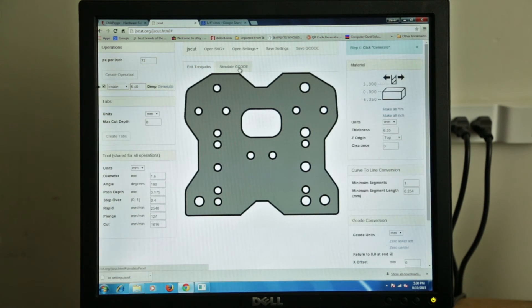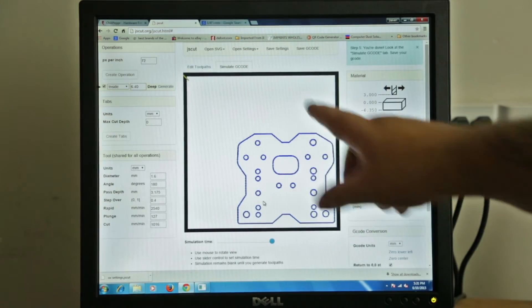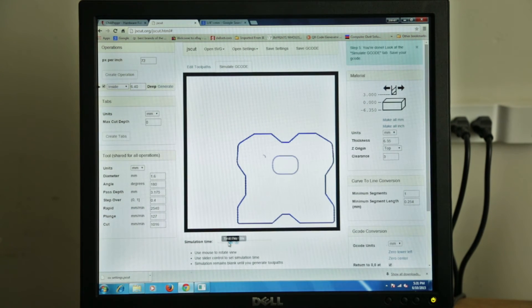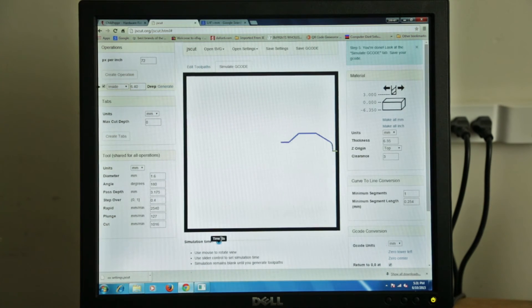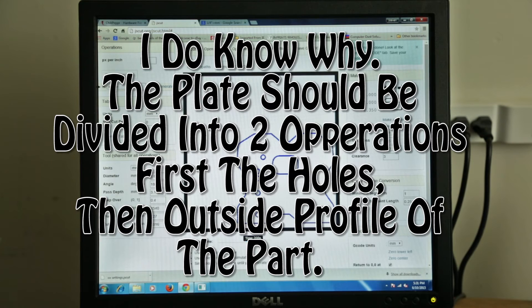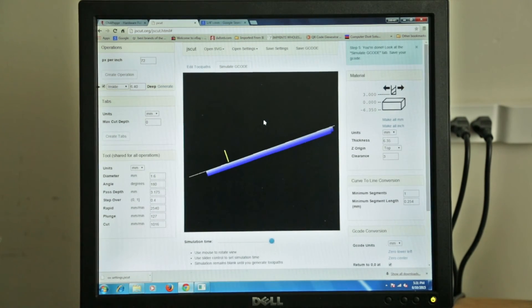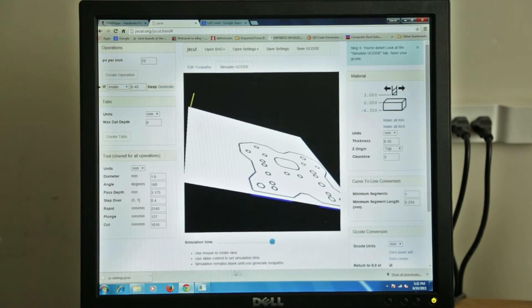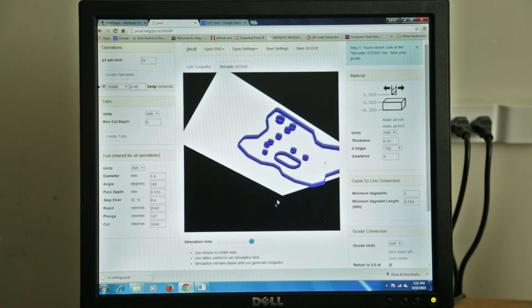The last step is to simulate our code — I want to look at it and see what's going on. You come over here and click Generate, which generates the G-code and the tool path. You can see right here where the tool is going to travel in yellow. If you click Simulate Code you can see where it's at, and if you pull the slider back and forth you can see what the operation is. It starts drilling the holes, and it starts cutting the plate first — which is kind of strange; I need to ask some questions about that. You can left-click to raise the viewport and look at it, and you can see it's a quarter-inch thick piece of material and watch the tool travel.